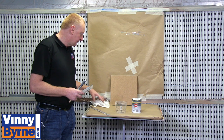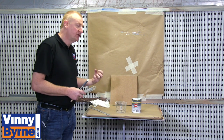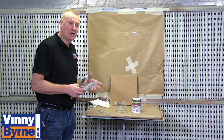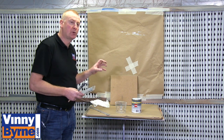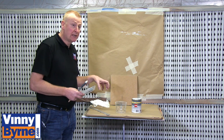In this video for this demonstration I have a piece of MDF wood. Obviously you can use whatever you need — whether it is a concrete surface, a steel surface, or a plastic surface. It makes no difference. The main thing is that for the surface you are painting, you use a suitable primer or ground coat to adhere to it, and it must be white.